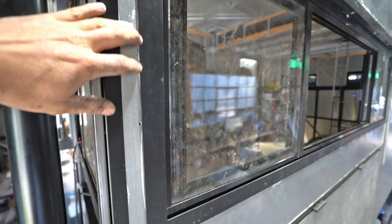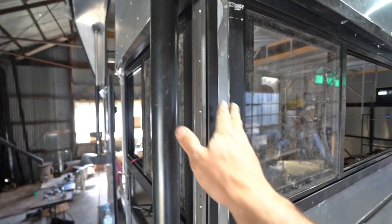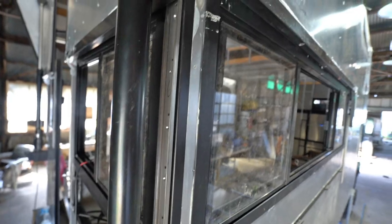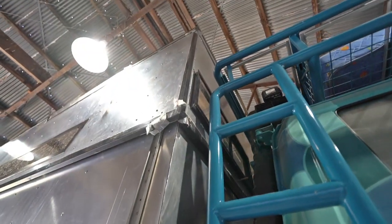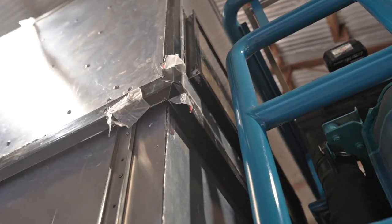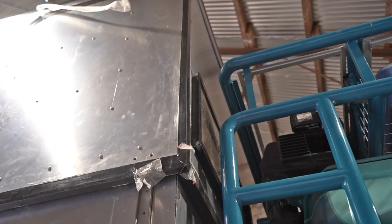That's the windows glued in. You can see they're glued inside their frame and that's all watertight. All these windows are on the lower half of the truck. One of the reasons I made these frames and glued them inside was so they didn't stick out past the face of the cladding and wouldn't intrude with the roof as it comes up and down. But there are two windows installed in the roof, down the front — one on each side — installed in the pop top roof, so they had to poke out a little bit more to finish flush on the inside of the roof frame.